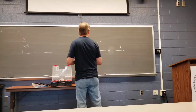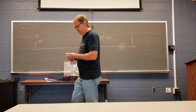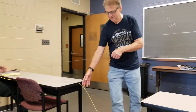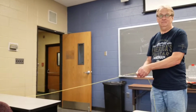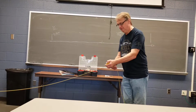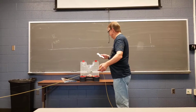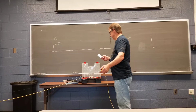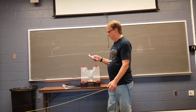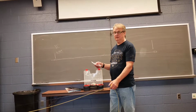So we're looking at, what's half of that? 16.5. 16.5, that's right. Terry, where did you get 33 feet from 21 meters? 468 over the frequency. But 468 for 21 meters is 69 feet. What do you mean 21? 20 meters. 20 meters is about 66 feet. Okay, yeah. 300 over 14.2 is 21.126 meters. Right. Convert that to feet. 69 feet, you're cutting it in half, right?